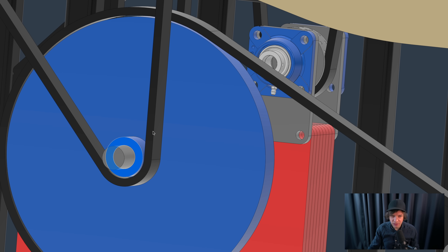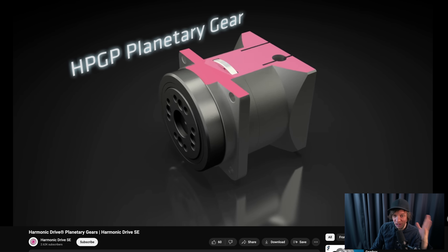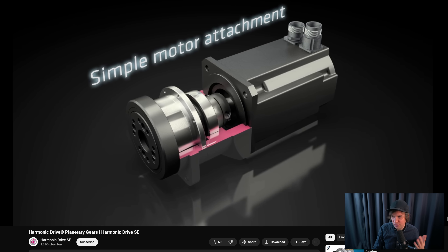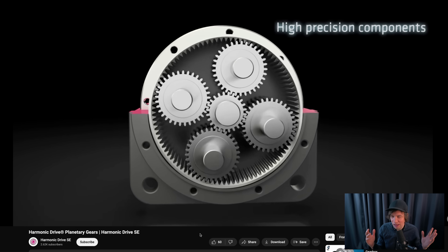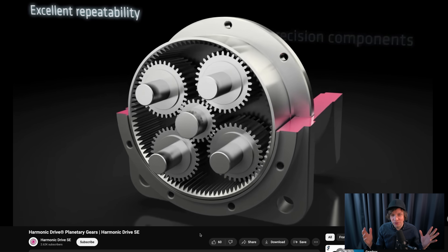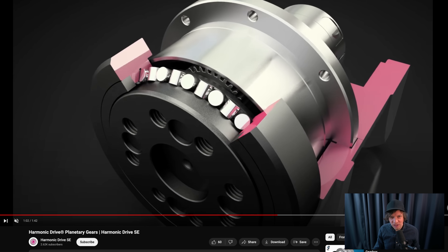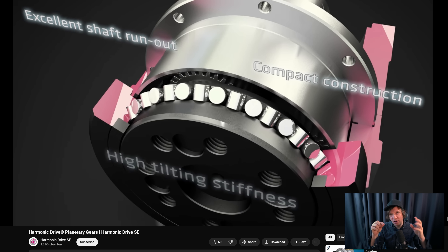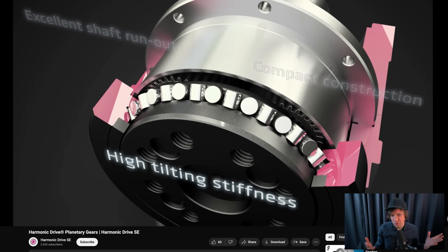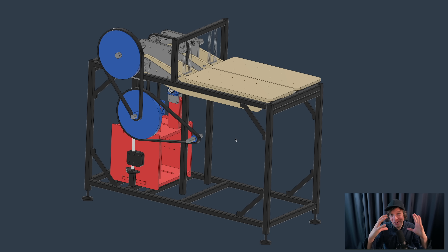A couple of idlers will be needed in this solution. Another option is to buy a gearbox from gearbox suppliers - there are a ton. This company is famous for their harmonic drives, but they also make planetary gearboxes. This looks like a magic bullet - beautifully engineered, a solution off the shelf I can use to put one part on the machine and be done with it. However, most of these options are used to gear something down - a high speed motor is the input shaft and you get a slower output. I want to gear something up, and I'm not currently aware of the efficiencies of these gearboxes when you back drive them.